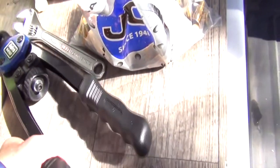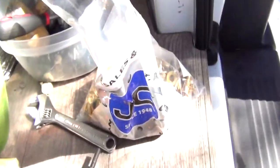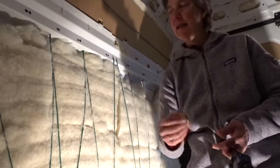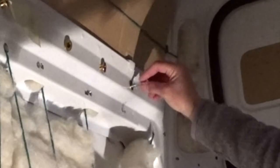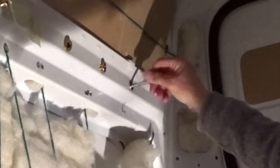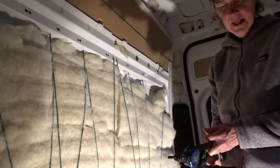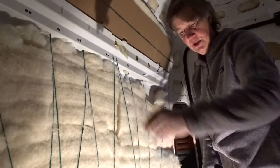The tool I'm using is the Astro 1450. There are different ways you're told to do it, and here's what's working for me. This is a 5/16-18 pre-bulbed Plus Nut. I have one that's installed here — you can see the bolt just goes right in and threads right in there. That will hold my boards in place. These particular hex holes I think are for metric, but they actually work well for getting these in. Let me show you how I do it — it tends to bounce around when you hit it with the mallet, so I put some masking tape over it to hold it in place.